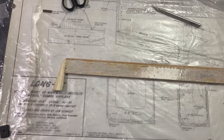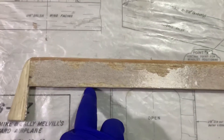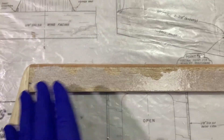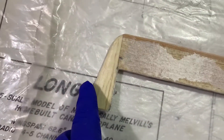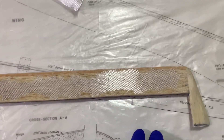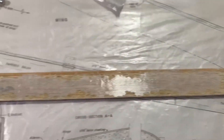As we continue our update here, we're looking at the canard. We've got our fiberglass trimmed. We used our CA on our trailing edge and on our leading edge — a little bit leaked over in the center, but that's okay. When you put down your fiberglass, you can use all CA through the whole process. You can see it went on really nice over here on the edges. So now we're going to take our Hysol 120 epoxy and go ahead and apply it over this section and also the other side as well. More to come.